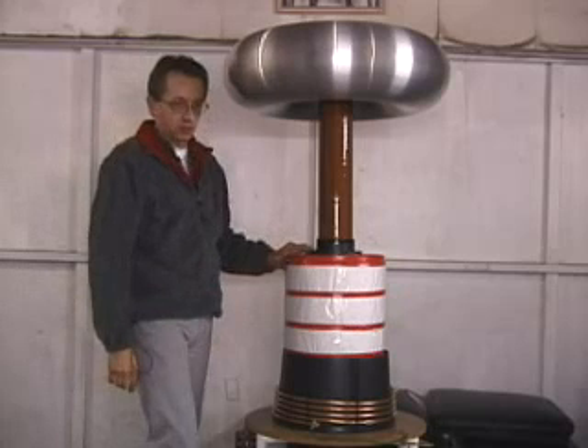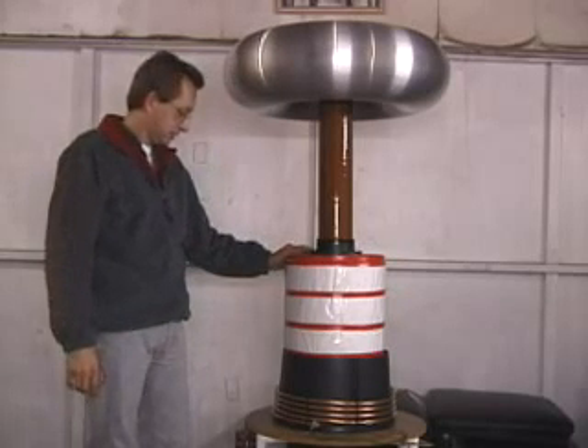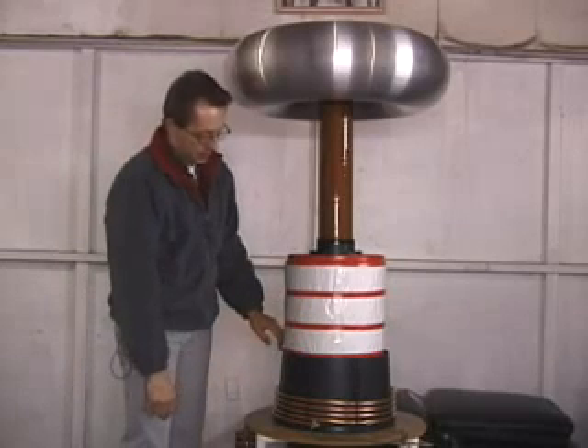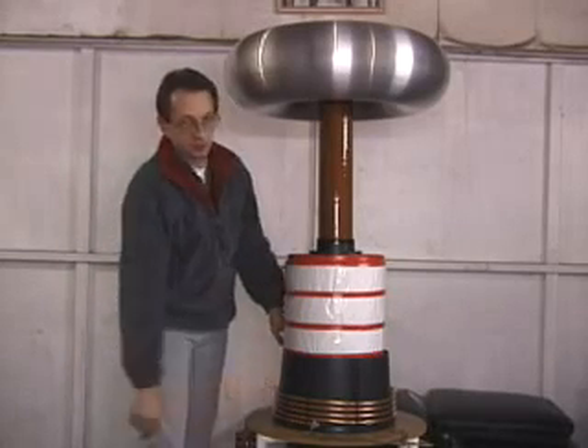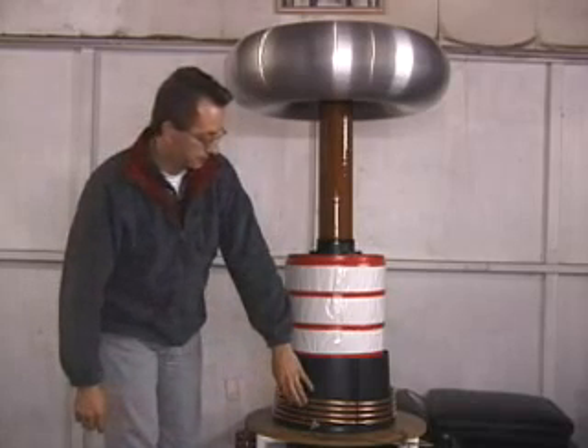I believe Terry Chris has one of those sections he was going to use for one-to-one HD testing. The primary coil is nothing more than — I went to the hardware store, got a bucket, cut the bottom out of it, and used it as a form to wind the primary coil on. I used a tie-wrap method to secure the 3/8-inch soft copper tubing on there.